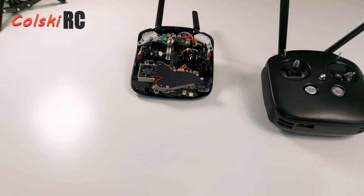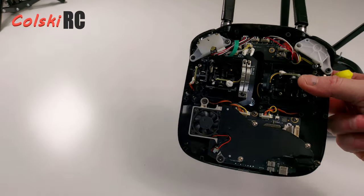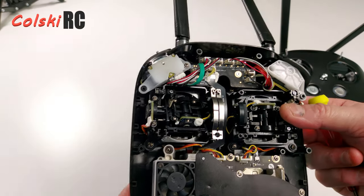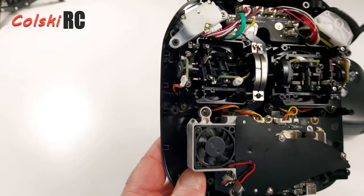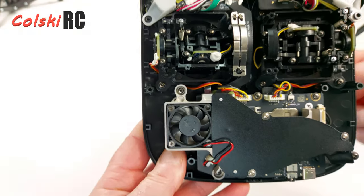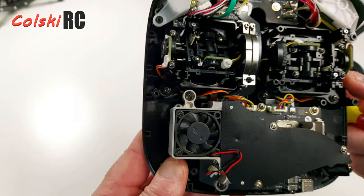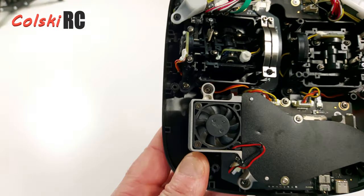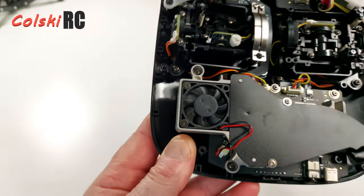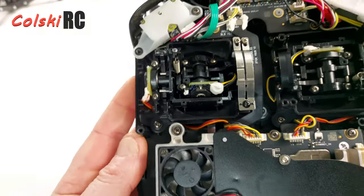Am I happy with the state of affairs? Not at all. I honestly believed I could just go buy a gimbal — maybe 50 quid for a pair, and I even thought about converting to hall effect. If you've converted one of these to hall effect gimbals, let me know. These feel fine and probably won't feel any better with hall effects in, but since I've got it stripped I'd like to try. It shouldn't be an issue wiring-wise because the board just needs the sensor signal — it doesn't need to know whether it's a pot or a magnet. But yes, in here we have potentiometers.